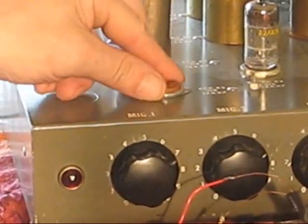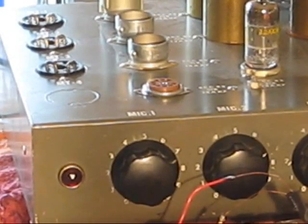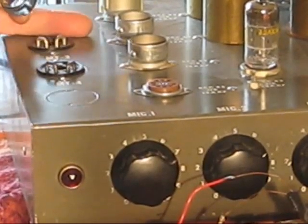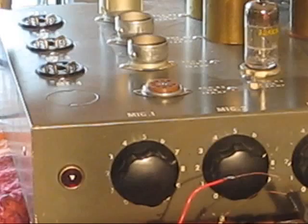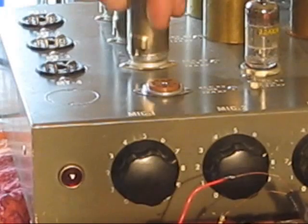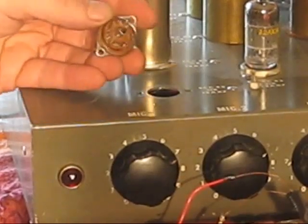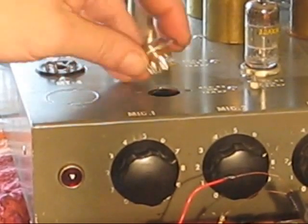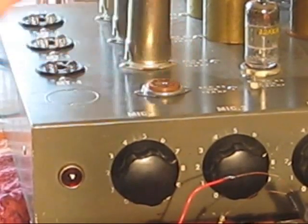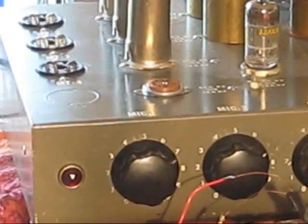So there's a spot for the tube. I could, because I've got these 2 unused sockets here, just use one of those, or both, for other things, since I really only need 1 channel for my guitar. I don't share my amplifier with other players, other than the PA. But since I've got the hole, sockets, appropriate sockets and screws, I'll just put a new socket in there. I've done it before for indicator tubes and things with these amps.